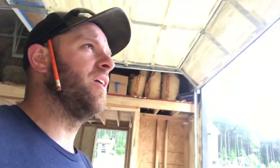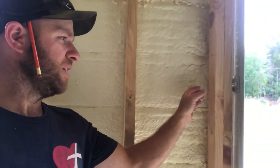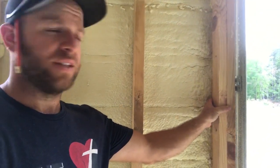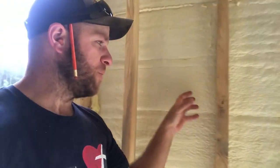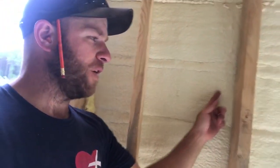We did learn the hard way, unfortunately, because we're not completely done with framing. He said, oh, that won't be a problem, no big deal, you just go ahead and keep framing afterwards. And in my mind, I said, okay, well, we had 2.5 inch metal studs, and then we were coming out another 2 inches with the wood studs. So that's a total of 4.5 inches. So if you put a 3.5 inch 2x4 here, then there should be an inch of space for the foam. But in most spaces, there's not. So luckily we had most of the framing done.